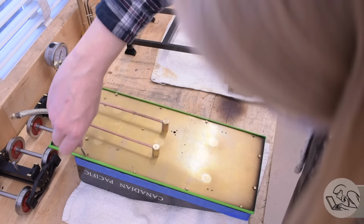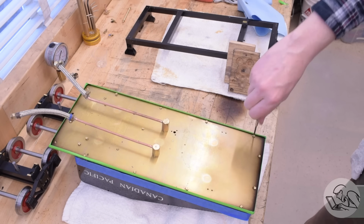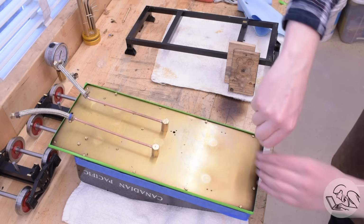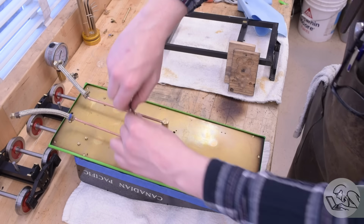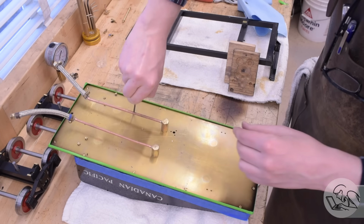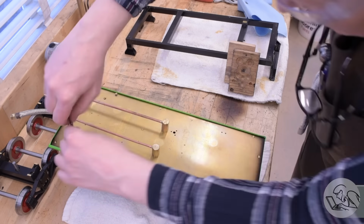However, I tried to install that pump on a dry run through the opening in the top, and I couldn't do it. My hands just could not get into that little maintenance hatch, and it just looked like it was going to be incredibly difficult. What I found, though, instead is that it is possible to thread the frame on over those hard lines. You can kind of sneak it in underneath them, and that allows you to do all of the pump installation, the plumbing and everything, test everything, and then put the tank on. I found that much, much easier.